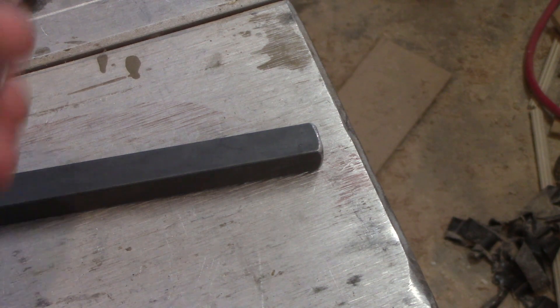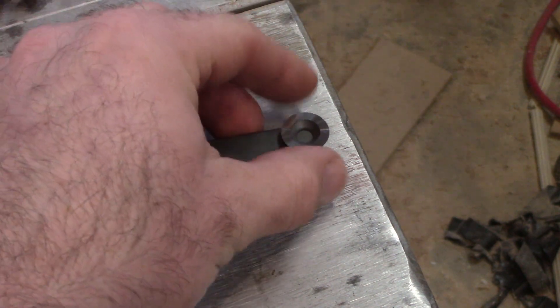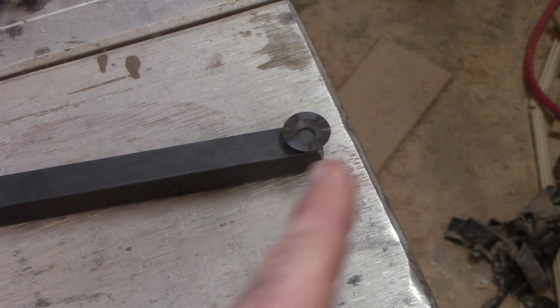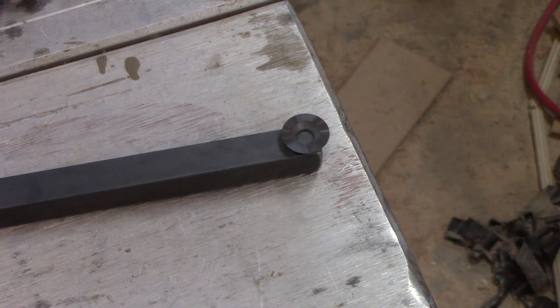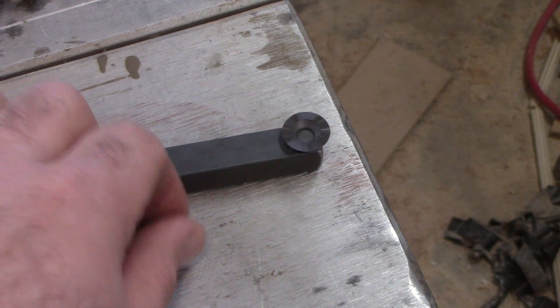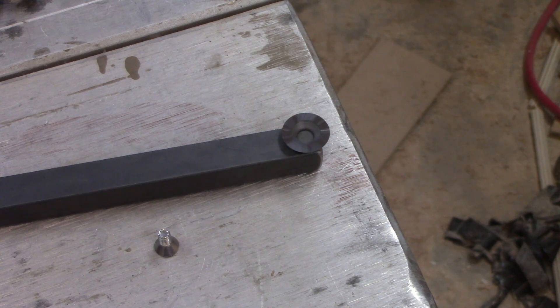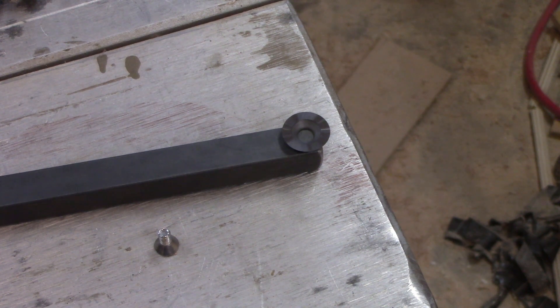There's the end we already have rounded over. We're going to have to have this sitting pretty close to that edge - not too close, but pretty close - so that way you can actually use that cutting edge. You're definitely going to want to use a drill press for this. If you do it by hand when you're this close to the edge, your screw may not be in the right spot and you could lose a lot of strength. I'm going to be using a drill press personally. You may want to start with a smaller bit and then move up - maybe use an eighth inch pilot bit, or even a sixteenth of an inch. Whatever you feel comfortable doing.